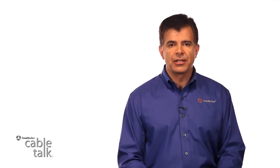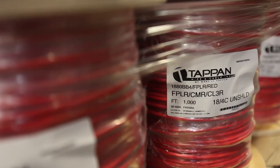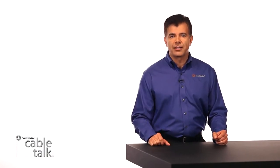Plenum is a commonly used term today in the construction and system installation industries because in most cases, plenum rated cables may be installed in air handling systems, air plenums, without expensive metallic conduit. Plenum cable can cut installation costs dramatically. Riser describes cables having a lesser degree of flame retardancy than plenum, but may be used to convey signals vertically in shafts without requirement for metallic conduit.